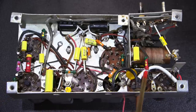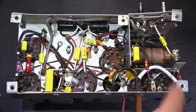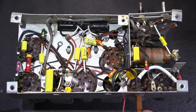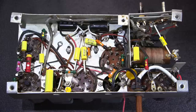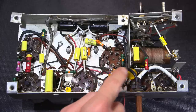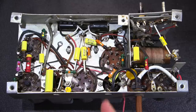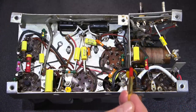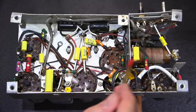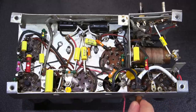The added piece of high-heat shielded tubing runs over here into this area just to keep things protected in this other area, in case something was to ever flex this down and this would touch the tube socket pins. I wouldn't want anything to melt through the insulation. This is clear of everything over here. And as you can see, it's a ways away from the wall. But if that was to ever push in and something was to cut into the wire, it wouldn't matter because this is neutral anyways. This is neutral and this is neutral. But it is a ways away. Nothing is ever going to touch.